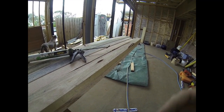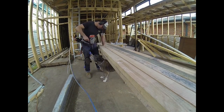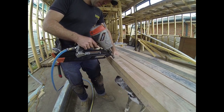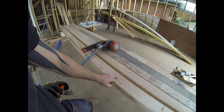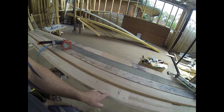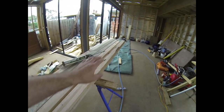We then pin with our nail gun. Once we've done that, we run across and angle it both ways — so one nail goes facing upwards and the other one comes the opposite way. You can see here that we have nailed in opposite directions, keeping the nails no more than about 90 to 100 mil apart as you space them. We need to keep them about 90 mil the whole way, staggering them and making sure you go opposing angles — one nail skewed that way, one nail skewed the other way. That holds the timber in place.